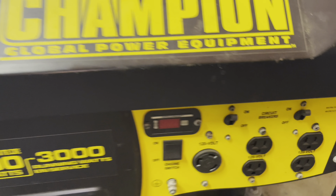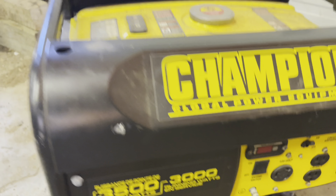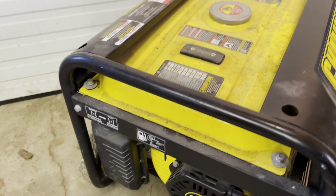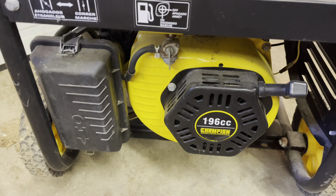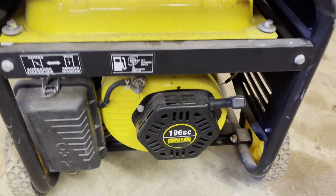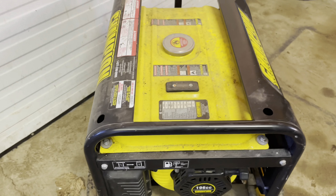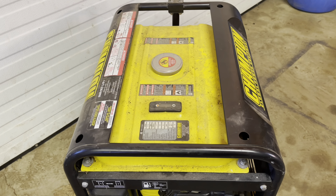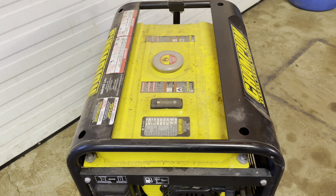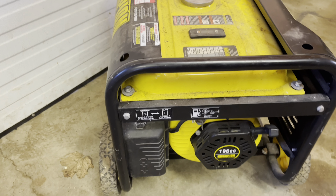It's got a little hour meter — it's kind of a nice little generator. It's not big, but it's enough to run whatever you need. This is a 196 Honda clone motor, which are great. The first thing we're going to do is drain out the fuel. If the fuel looks okay and I don't have to flush out the tank, I'll just throw the carburetor on and we'll see if we can get this thing running.